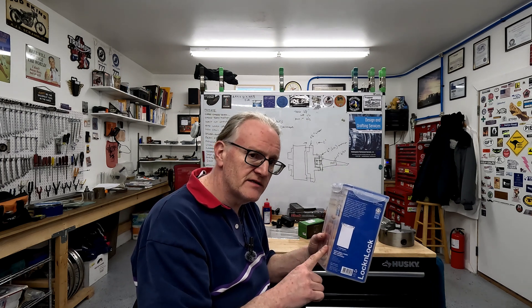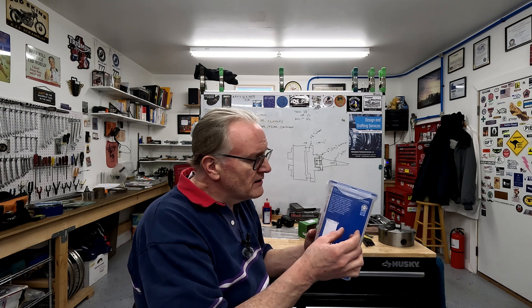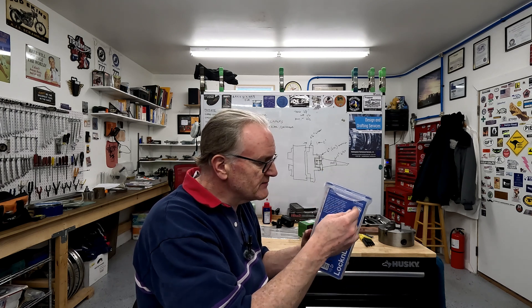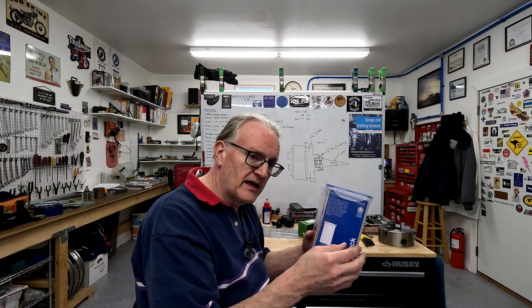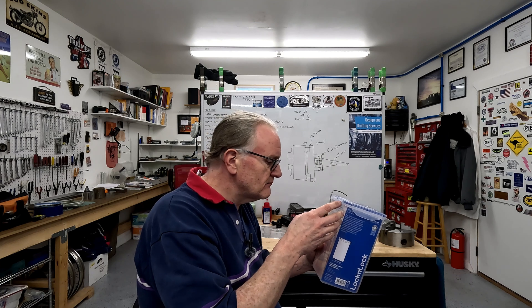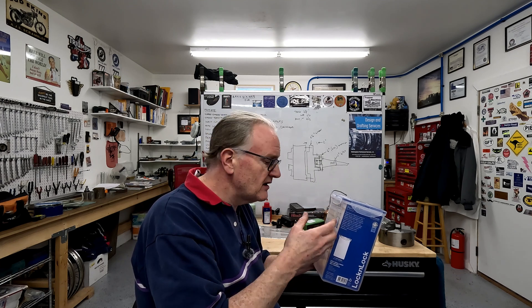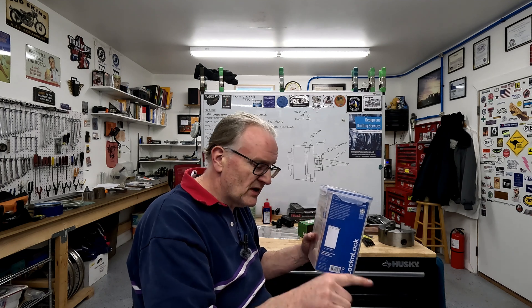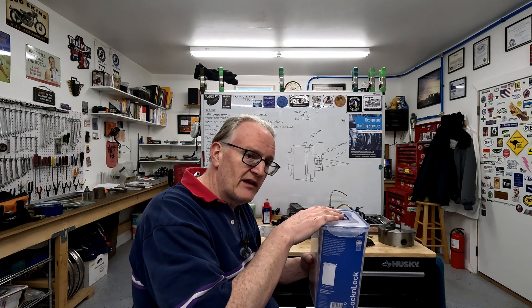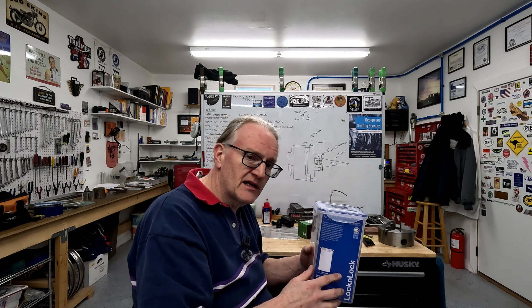What I'm going to do is put the aquarium pump inside this container. We'll have a hole in the bottom here and the exit from the aquarium pump will come right out into the main sump. We'll cut some slots in this for the fluid in the main sump to circulate into this container. The motion in the fluid caused by the pump, as it draws in from this container and pumps it out into the main sump, will draw all of the oil into this container, keeping it in one place, away from the pump that circulates to the machine.